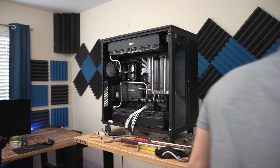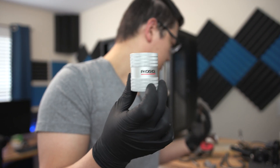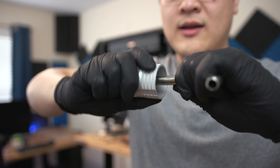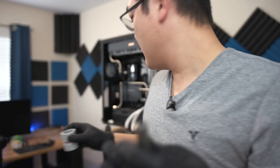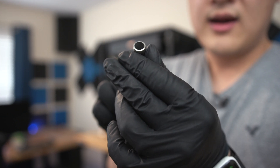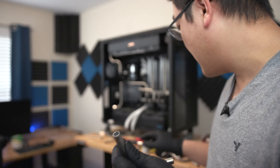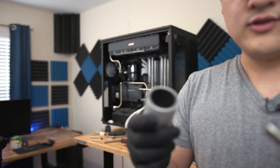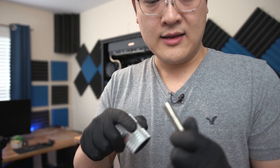To deal with the sharp inside, grab a tool like this — I think it's called a reamer tool. I bought it as a set with my cutter, so I'll link everything in the description below. Basically, you point the sharp tip inside the tube, do a couple of rotations, and just like that you've smoothed out the inside so both the inside and outside are safe. If you flip it around there's an inverted chamfer deburring edge on the other side, but I really don't find the need since the outside is already very smooth.